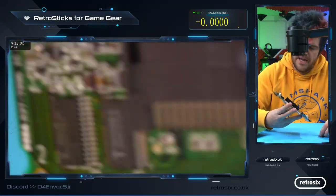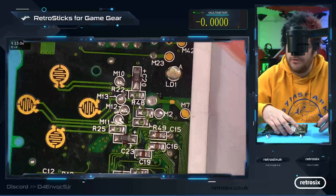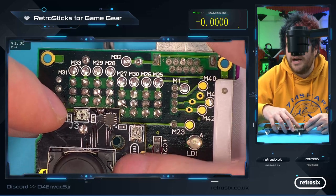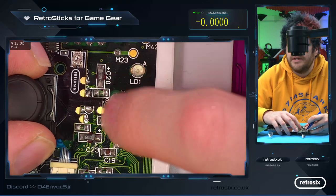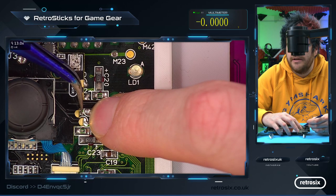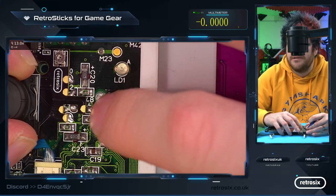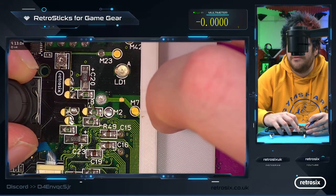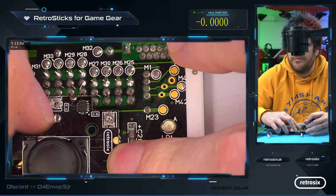If I just bring in a 2-chip, this fits all boards, but on a 2-chip, you'll notice if we place this down, you place it roughly there. You can still see you've got your solder blobs, so they look partly hidden, but they're there, there, there in that one, and there. So the same blobs, but now when it's lined up, you'll find this pad goes over to the edge of this resistor, which is R48. So the left pad of R48 is your 5-volt rail. So when you see the resistor here, R48, solder to this and not the top piece.